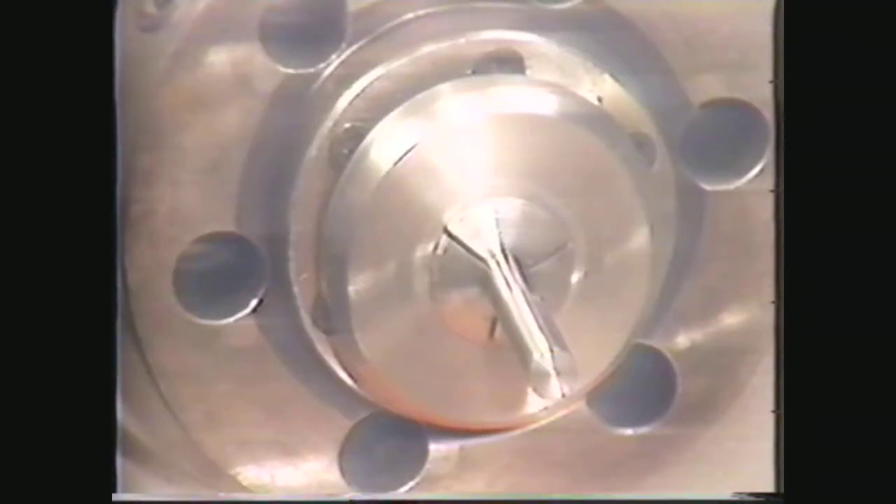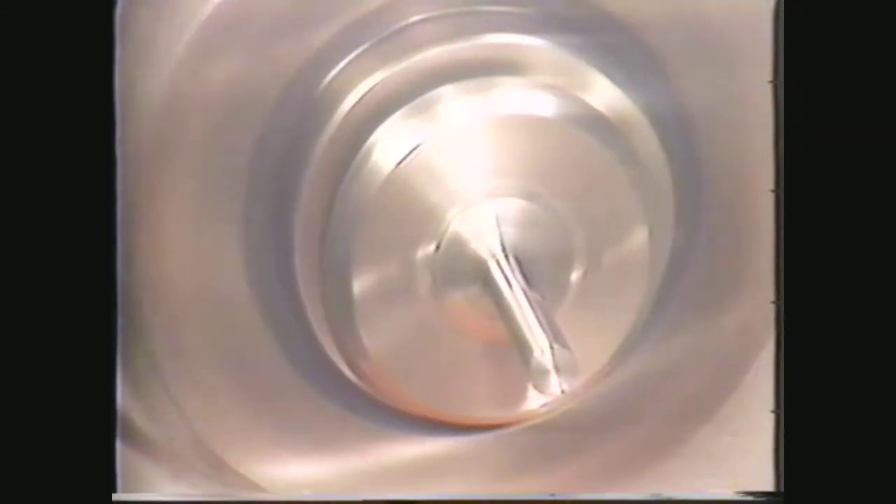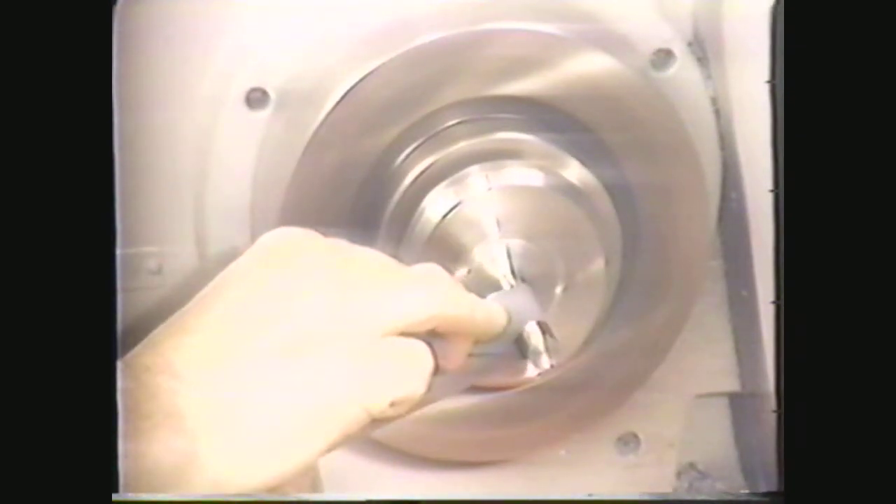For polishing work of small diameters, you may want to use a collet chuck. In this way you get rid of the chatter caused by the unbalanced weight of the lathe dog. Here you see a small diameter piece being polished in a collet chuck.